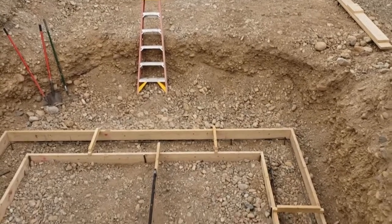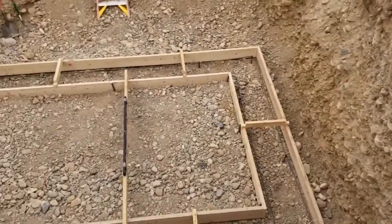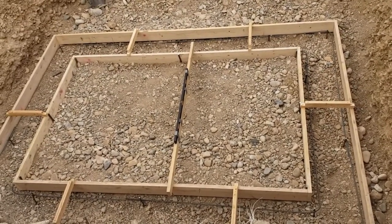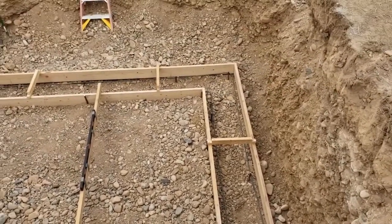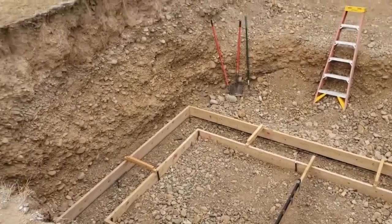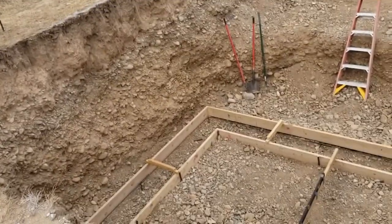The dimensions of this root cellar are going to be 12 foot long by 8 foot wide, and we're building to inside dimensions. I put a 20-inch footing here all the way around. We'll be stacking 1-foot foam blocks 8 foot high, so we'll have a fully dug-in root cellar. From ground level down, that's about 8 feet — yes, exactly.